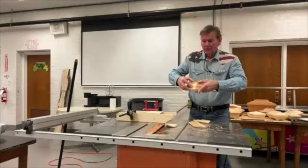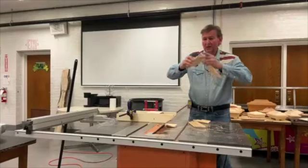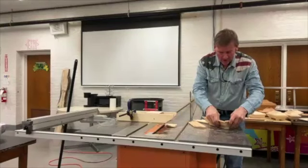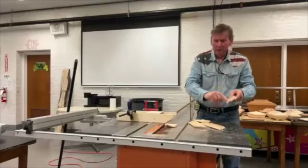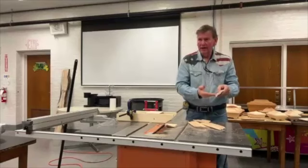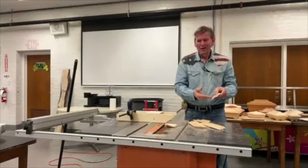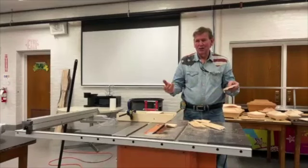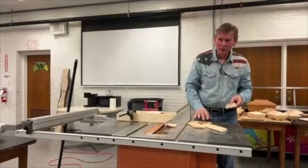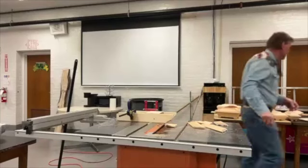Now, the joints are easy, automatic angle. This is what the box is going to look like up. You're going to have this much of an angle on your sides. Now, we need to cut a slot. This slot is where the 1/8 of an inch, I use 1/8 inch Baltic birch. These are small enough that you can just rip yourself a piece of 1/8 of an inch anything on the table saw, but I find it convenient to use the 1/8 inch Baltic birch.